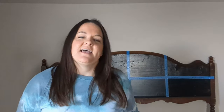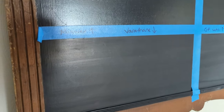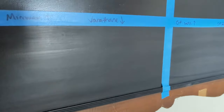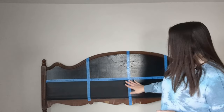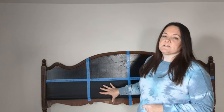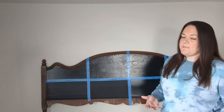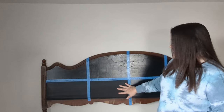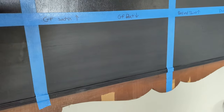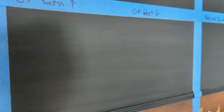Let's start with the problem sealers. The Varathane water-based polyurethane — you can see the direction that I applied the sealer in a slightly stripey fashion, which is definitely not what you want. Then there's General Finishes High Performance Top Coat in the dead flat finish. General Finishes is my favorite sealer for actual furniture painting projects, but knowing black paint and matte finishes don't always get along, I tested the flat finish too. And while it does have a nice matte finish, it's even streakier than the Varathane, with lots of grayish stripey-looking patches throughout.